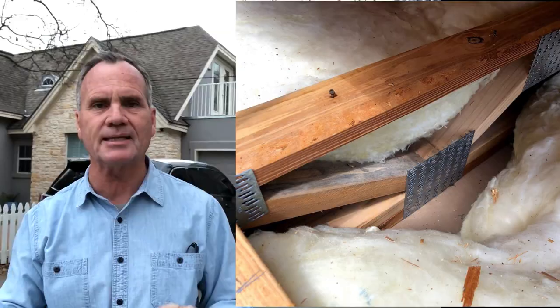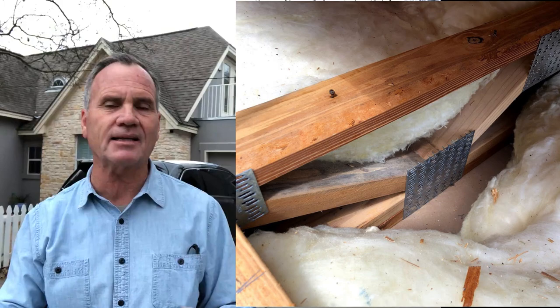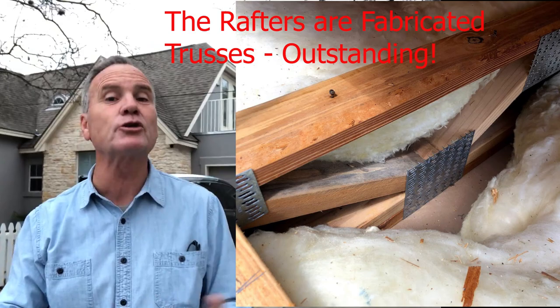The other thing that we got to look for is that they use standard industry specifications. For example, International Building Code requires certain rafters to span the distance. We've got to confirm that that's correct because the porcelain is heavy and it is not so heavy that it cannot go on a standard construction, but you've got to make sure that somebody didn't take a shortcut back when this was built. So we're going to be back with you on this project a few times, give you more information, show you a few more videos of the work in progress.